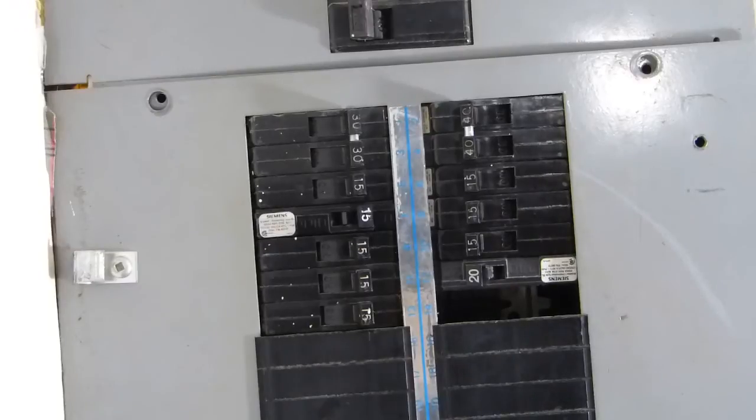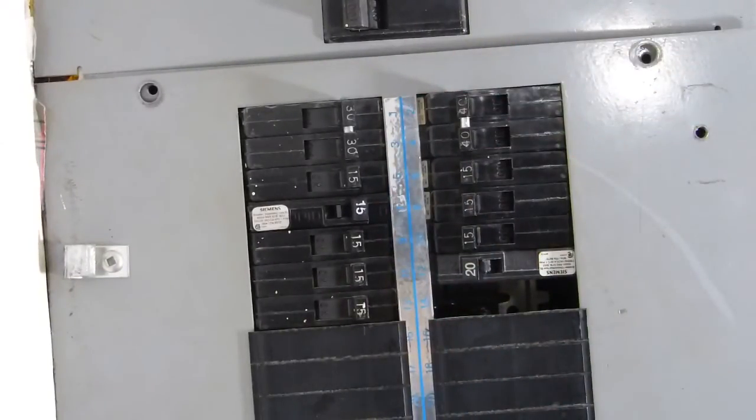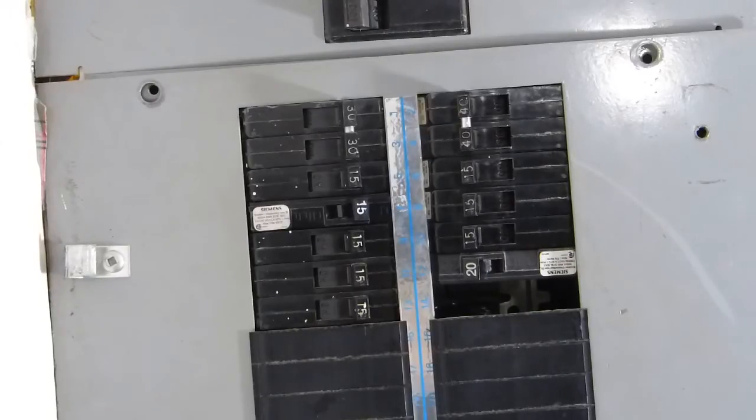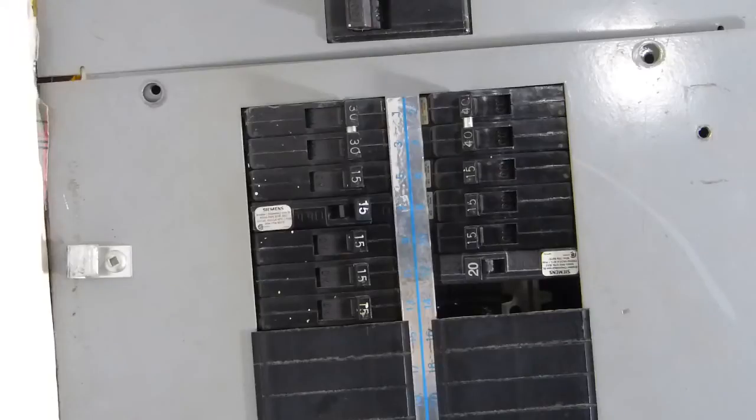Those overloaded circuits heat up and lead to electrical fires. It may not have led to an electrical fire for the previous homeowner, but it may for you, the new homeowner, who doesn't know about the quirks of the building or the original design loads on the original number of circuits. The seller may only have a dog and a single TV, but if you have five kids, power tools, kids running electronics, and someone always working in the kitchen, you might be overloading some of the patched-in circuits spliced into existing junction boxes. Having an electrical house fire and living outside your home for any length of time is no fun. The only way to have any proof that nobody's tampered with the original circuits is to take a close look.